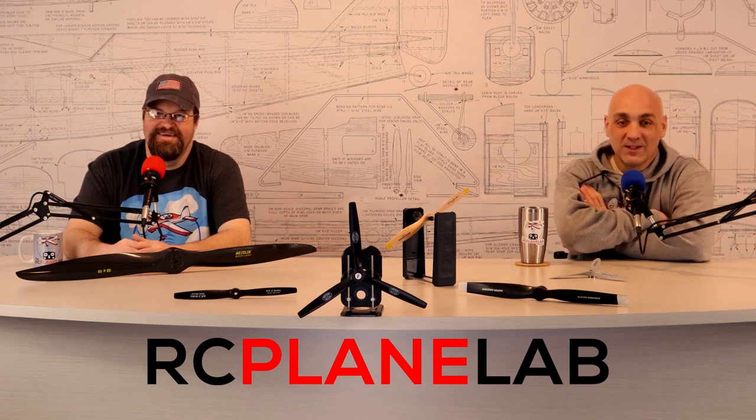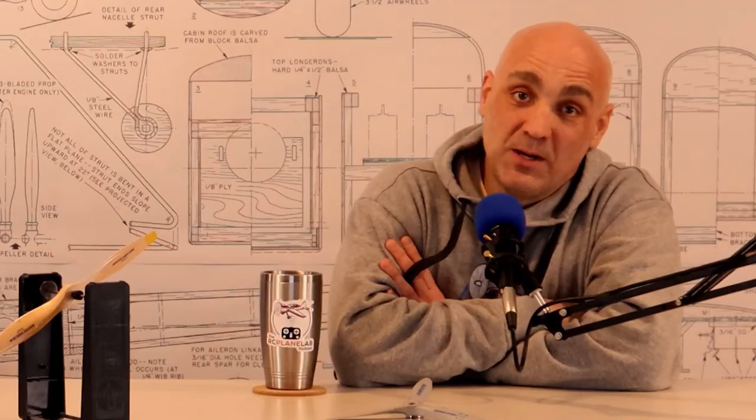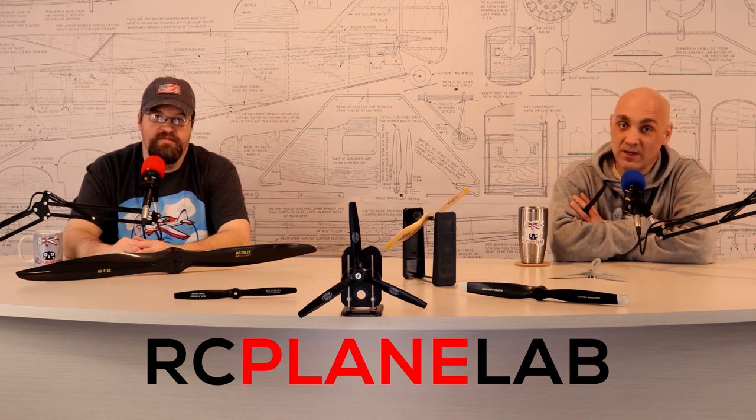But anyway, you know what else it can do? And this really, really bugs me because, like you said, I like pretty airplanes. I like for them to look nice and not have any flaws, if possible. A propeller that's not balanced will cause your cowl to vibrate. What that does is it elongates the holes, which allows it to vibrate more, which then causes that black kind of scarring on the cowl. And it just looks bad. I didn't realize that was caused by an imbalanced propeller. Well, vibration is what elongates those holes, and vibration is usually caused by an out of balance propeller.